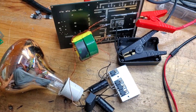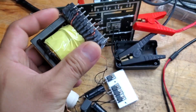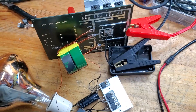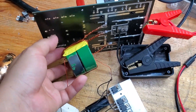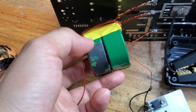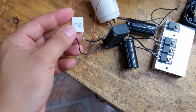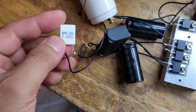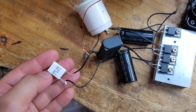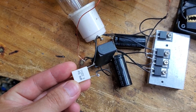This is my new project. I will use a toroidal transformer to replace the conventional transformer in DC-DC conversion circuits. I will need to test the efficiency and evaluate the performance between the conventional EI transformer and the toroidal transformer. To do this, I will connect a small resistor in series with the output of the circuit — here I am using a 0.22 ohm resistor. Next, I will measure the resistance as well as the voltage drop across this resistor and apply Ohm's Law to accurately determine the current value.